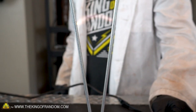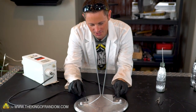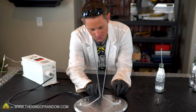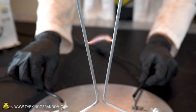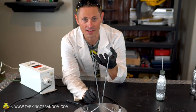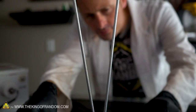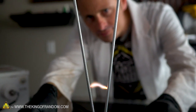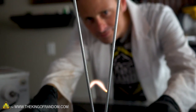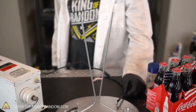Let's talk about the Jacob's Ladder for just a second. When we take our two high voltage electrodes and connect them to the terminals, the electricity will arc at the path of least resistance — right down at the bottom where the two points are closest. As that arc heats up the air, it naturally travels upward, continuing to flow through until it stretches so far it snaps, then starts again at the bottom and repeats over and over.